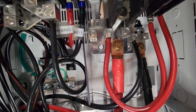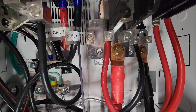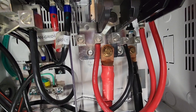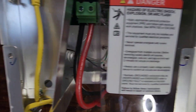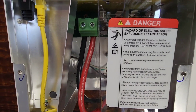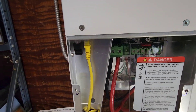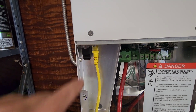The positive battery cable comes into this bus bar over here, and the negative obviously goes in there. The two smaller wires you see on there are going over to the charge controller. This is a 100-amp 600-volt charge controller, and you'll see there's also a Xanbus cable and a little terminator — which means it's at the end of the line.